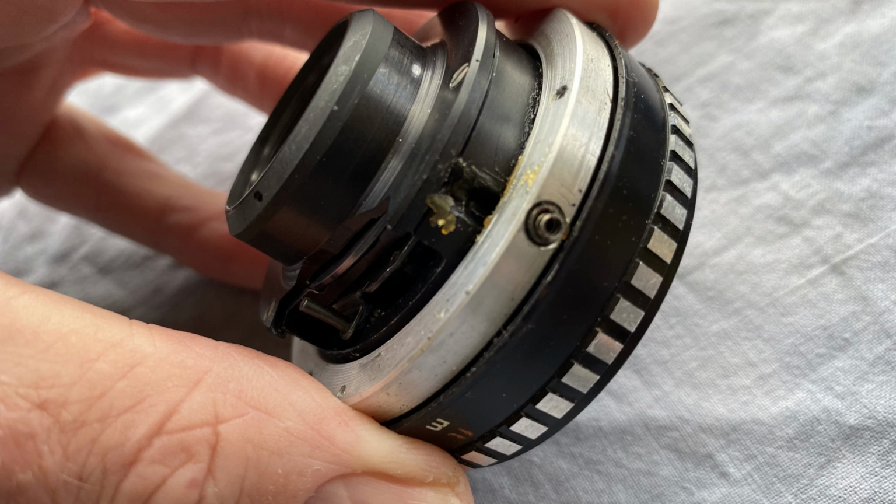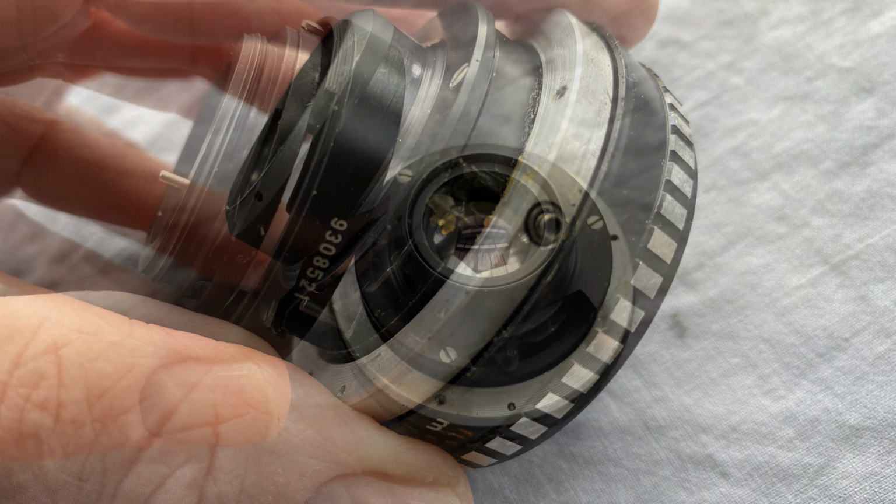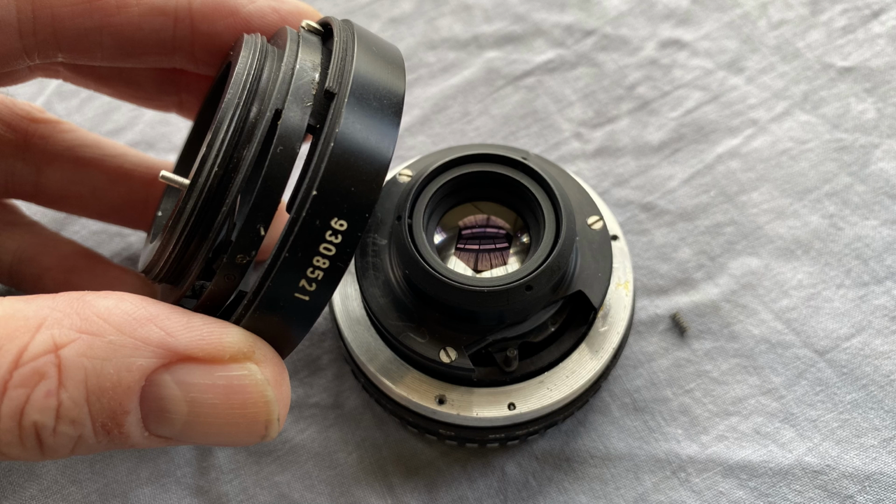Now, I won't pretend that getting the diaphragm actuator plate back on, along with the rear cover, which is part of it, which goes back over those springs and slugs, is an easy matter. In fact, it's a complete bear. The way that worked in the end for me was putting one side on first by slightly tilting that cover plate that's in my left hand and trapping in the spring and slug on one side, and then putting the spring on the other in the little gap that remained and pushing it into place and holding it there with a watchmaker's screwdriver, and then fiddling things until the cover slid down. There's a little lip that spring has to go over, and it is a pain. I had to strip it about 3 times to get it right, but it eventually popped in there. It just requires patience.